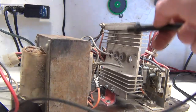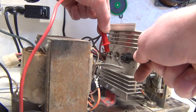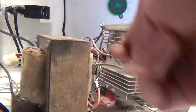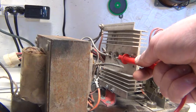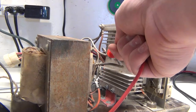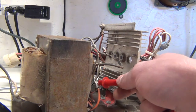This is the input here — we're getting about 29 volts open circuit. If I probe this with my scope and reference to ground — interesting — it's saying 70 volts to ground here and 95 volts to ground here. I would assume this is an autotransformer. There are some other windings here; let me check those. Across these two terminals I'm getting about 30 volts.